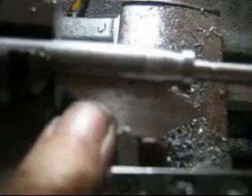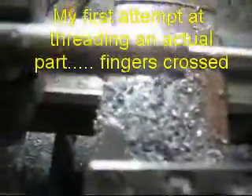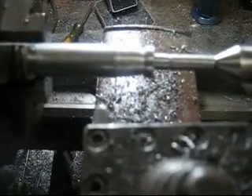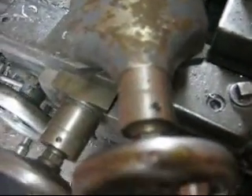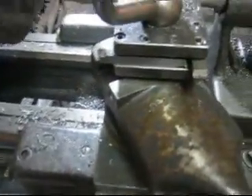I just copied the angle off a piece of six-sided stock on paper and made a tool. I barely had to touch it with a grinder - I almost made it perfect just with guesswork. I lined it up, got it all flat according to the part, changed my gears, checked everything again. Turns out I need 18 threads an inch. I touched off there, set my cross slide to zero, feeding with the compound at 29 degrees. I can use even threads - any number of marks - so I'm going to use numbers.